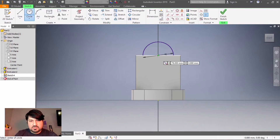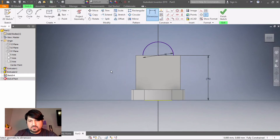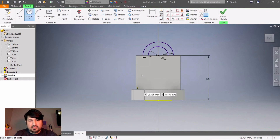Then we have an inner circle. Before I draw that, I want to check my dimensions using the Dimension command — click on the center part of that circle and go to the base to make sure it's 76 millimeters. It's over-constrained but I just want to be safe so that circle doesn't move. Next I'm going to place the other circle, and this one is 30 diameter.